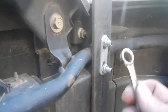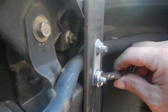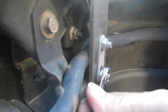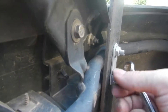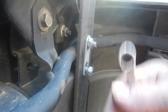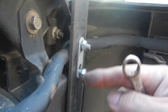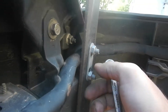The idea here, after dremeling that — and I might need to take a little bit more off that one — but in theory, because I've got those nuts on there, if I undo those now, that should in theory reset that thread on the end there. We're not going to have any problems with that at all, because the idea is to have the nuts on there, cut it off — providing it's not the hardest of steels — and then when you take that nut off, you should reset that thread and then obviously you're still good to go. There's a bit of a sharp edge on that — I'll finish that off later on. And there we go.